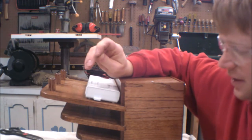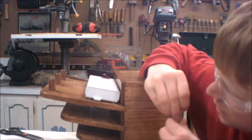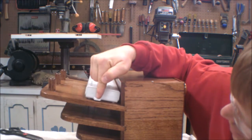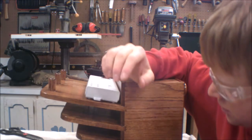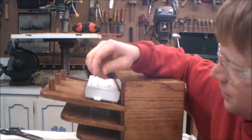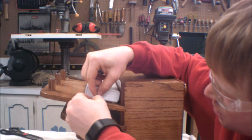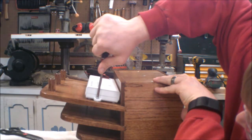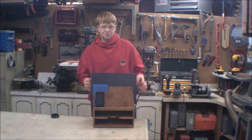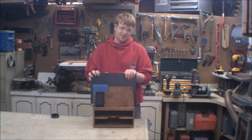This power strip was not designed ideally for this. It has tabs you can use to fasten it down with a screw, but it also has feet on the underside, and the tab does not sit flush with the feet — so when you put a screw and start pushing down, it puts tremendous stress on that tab and it's a good way to break it off. I have a washer that's just the perfect thickness to fit under here, so when I tighten it up, the washer can brace that little tab and I won't break it off. This project is a lot of fun to build, and I do have a free set of basic plans available in the description. Until next time, thanks for watching, and Merry Christmas!